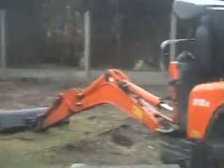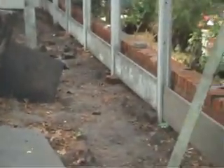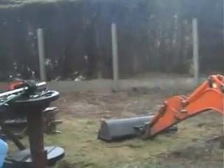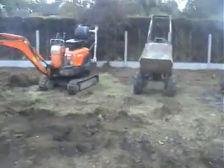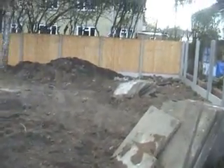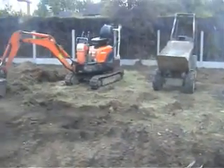It's the end of the day — it's after six. The fire's almost burnt itself out. We've got rid of all the greenery, buried all the rocks, and got all the gravel boards in all the way around, cut to size where they've not been a full one. They've had a pretty good day. I'm scraping some of the grass off now and putting it in the skip out the front — picking it out with the dumper and going through the garage — because if you bury too much vegetation in the low spots it will biodegrade and sink at a later date.